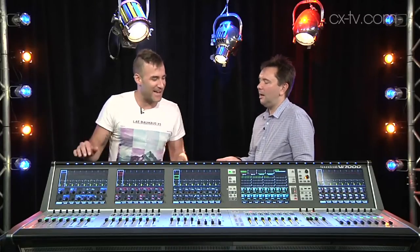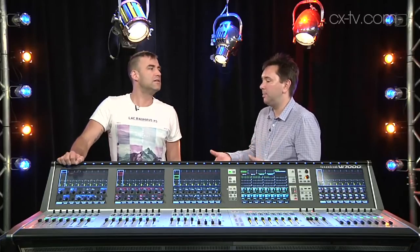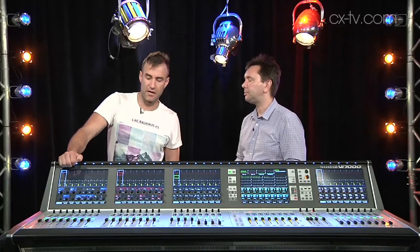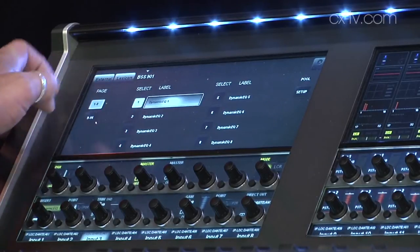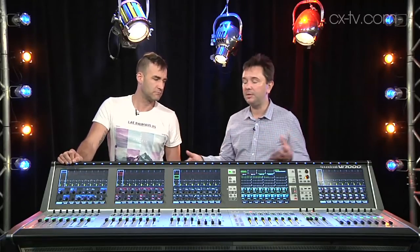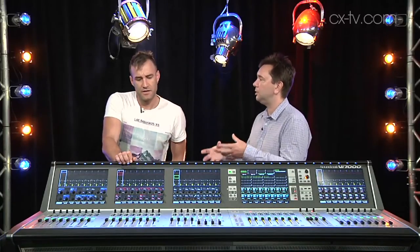That's what speaks to the big difference between this and the 3000. With the 3000 you were talking about an analog replacement or an analog-compatible unit, whereas here you're talking about a production company or venue that's already networked and used to running networks. The VI-3000 is a great drop-in replacement for analog, whereas this is something you spec if you are speccing a digital console. To get the most out of it you do need that existing fibre infrastructure, ULXD, or Dante-enabled microphones. It's got the same great Vistonics interface, the same Lexicon effects processing, an increased bus count — 32 that can be mono or stereo as opposed to 24 — and 128 inputs, but you need to be in that infrastructure world to really get the value.